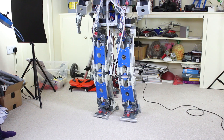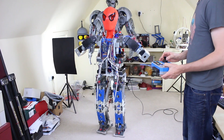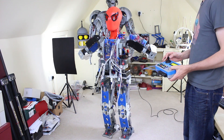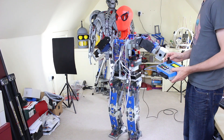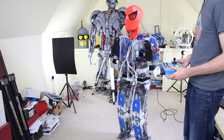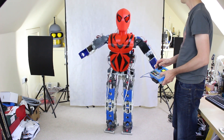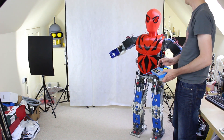I then reactivated the arms to see what difference that would make. Moving them at the wrong time does cause side stepping, because it comes down heavier on one foot than normal — but it's not too bad. With the body panels back on as well, it's pretty much all right, but it probably needs recalibrating every time I add mass, because it's coming down heavier on the feet and that affects everything, and the slope in the floor becomes more noticeable.